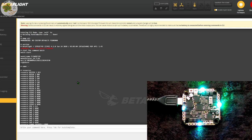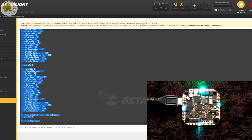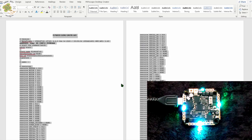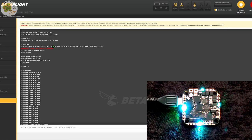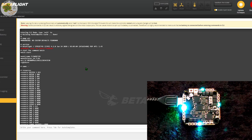This is always a good thing to do. We go to the hashtag version section, copy all of it, open a Word document, paste, and save it somewhere to your computer for safekeeping. The firmware it comes with — 4.2.0 — should work just fine as-is. There's no need to flash any newer version unless you've confirmed by reading the release notes that there are specific features in a newer version of Betaflight that you need.